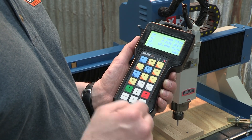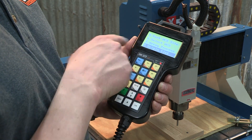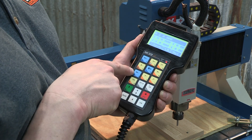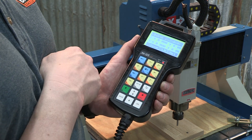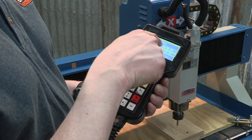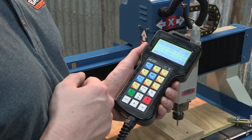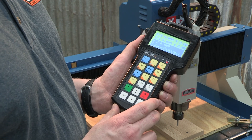Another feature of the controller is that we can save multiple different origins on the table. Go to menu, scroll down to operations, hit OK, and on line item number eight it says 'origin list.' Hit OK and where the spindle and gantry is right now, we can save that origin. Select it, hit OK, put a check mark by it, hit number 1 which is save, then hit OK to save our current position on the table. When we come back, if we have a jig or fixture to put on the table, we can call up that specific origin point. Provided we put the jig in the exact same spot, we can bring the machine right back to that exact spot without a lot of excessive setup. There are eight origins you can save — very beneficial for production work.